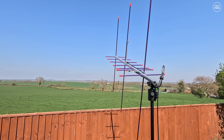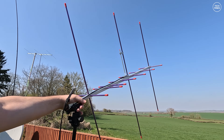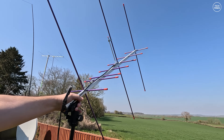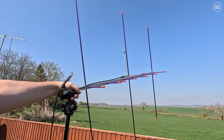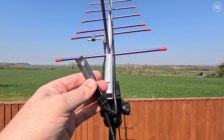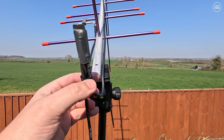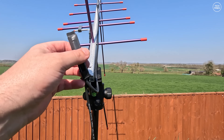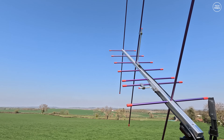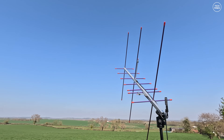I'll need to make up some brackets to hold both radios at the same time, and fix this to a tripod so it's easier to use. Something like this will do, but the ball head on this particular tripod didn't give me the range I needed in terms of elevation, so some adjustments or even building something new will be required. The grip comes off and you can pull out the duplexer, but if you're using two radios you won't need it anyway, as each radio connects to its own antenna. I may also need to consider rotation — I believe the 2 meter VHF elements generally need to be vertical.